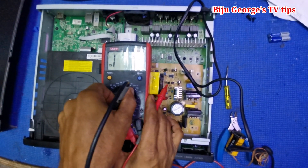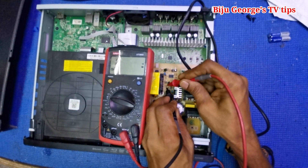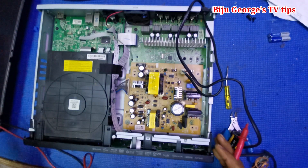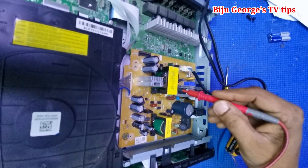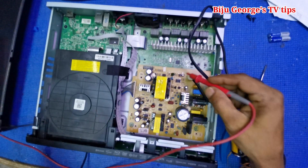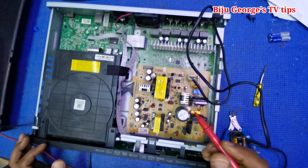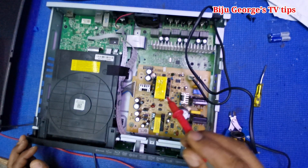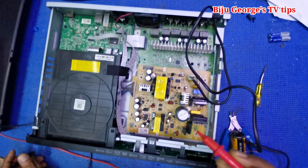Okay, selecting ohms and buzzer. See here - some zener diode is gone. And here, MOSFET also fired. This MOSFET - okay, MOSFET fired. Checking the IC point - under resistance check. No continuity - MOSFET has a direct short, zener diode is gone.